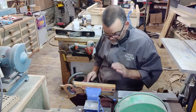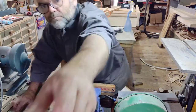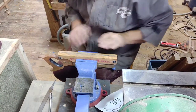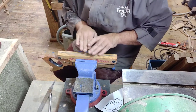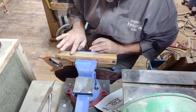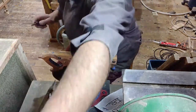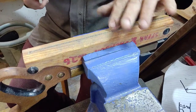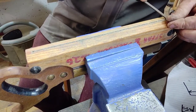That's one pass done. I have to decide whether or not I'm going to do another pass. If you look over the top of your teeth and run your fingers — carefully, so you don't cut yourself, just plucking the skin — if you feel it's actually grabbing all the way along on every tooth, you've managed to put an edge on. Back here I can feel it's a bit dull, so I'm just going to run the file across a few more times, but only a quick swipe and not too much aggression.